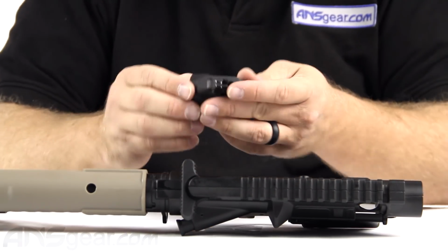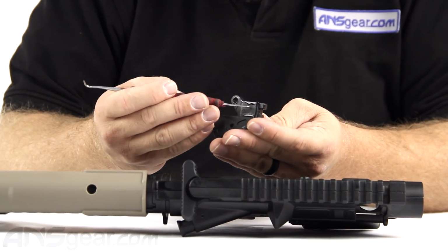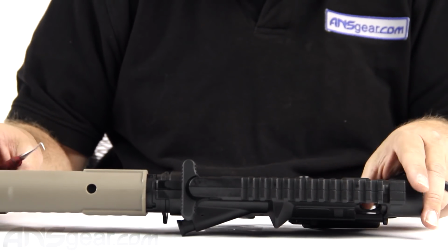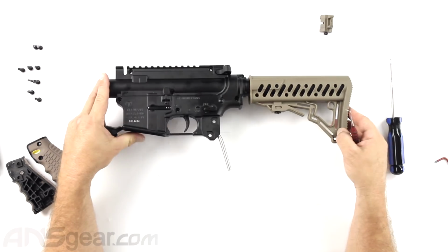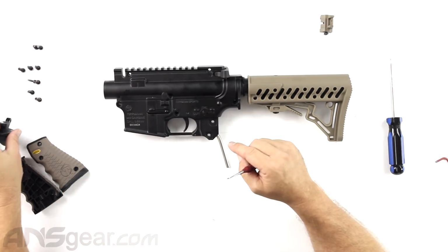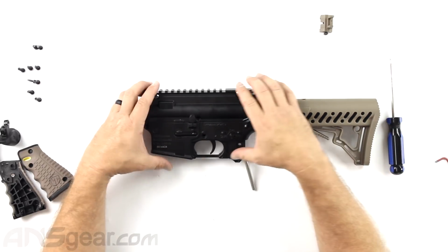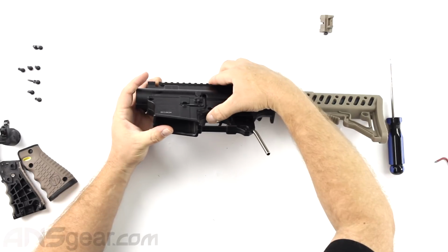And then at the bottom down here, inside, right about here, inside there, there's an O-ring. And that O-ring is going to go around the tube and seal the ASA to the air passage tube that goes through the gun and up into the valve assembly up there. All right, let's move on a little further here.